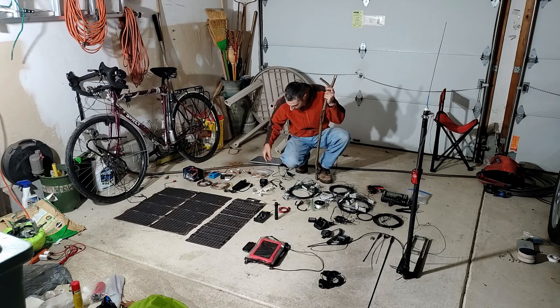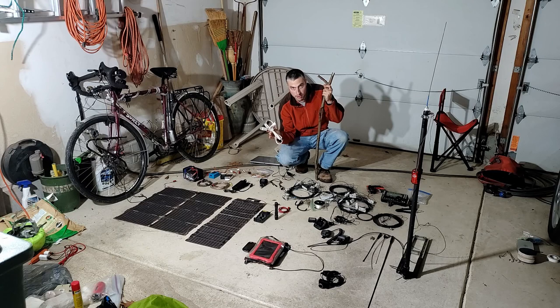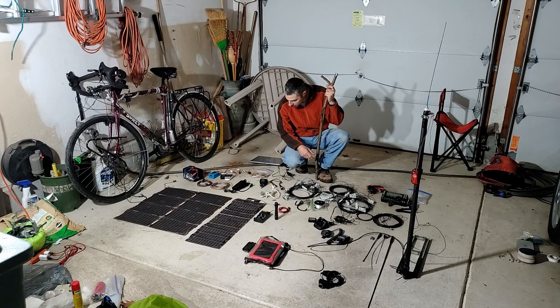But of course, you're never really going to be in a convenient spot to hit an AC outlet. So I've got one of these cheapy lamp extension cords. It's got three outlets on it. It's not a grounded cord, it's just hot and neutral. But in the event that I would have something to plug in that has a grounded plug, I do have one of those adapters. Not really the best option, but it's small and compact. It's not adding a whole lot to the kit. So that does definitely come in handy more often than not.